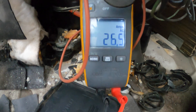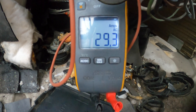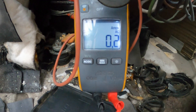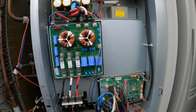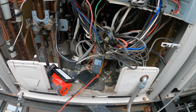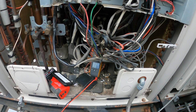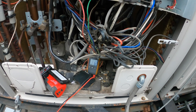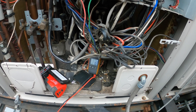See that? You see those amps? It jumps up — 20, 31 amps. Done. I knew it. And we got the error code. It is done. There's no reason to do insulation resistance checks, no reason to just check the board itself, because when you change this compressor, you change it with the inverter board. Another dead compressor.